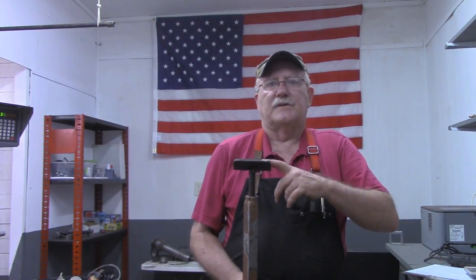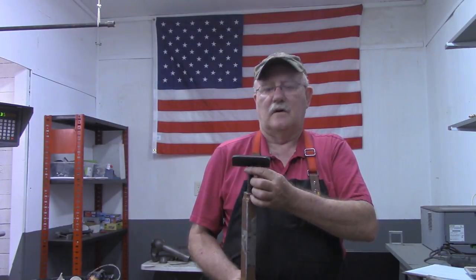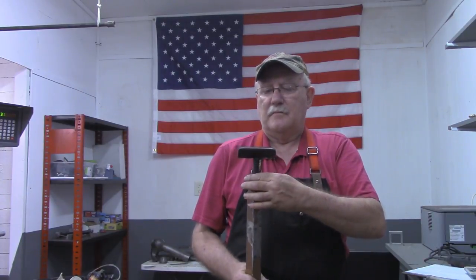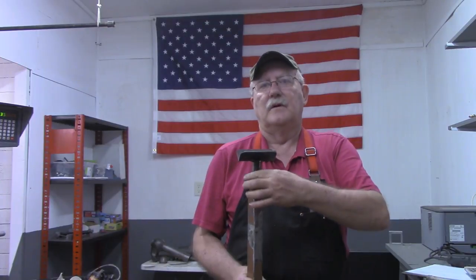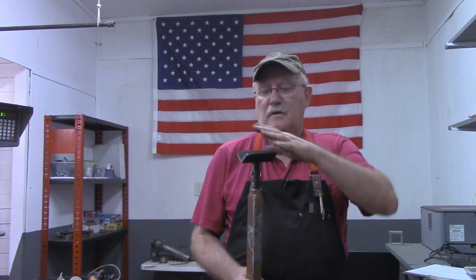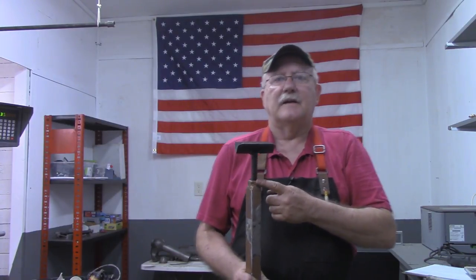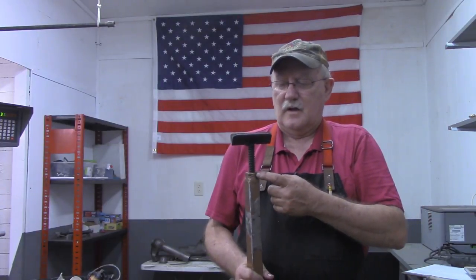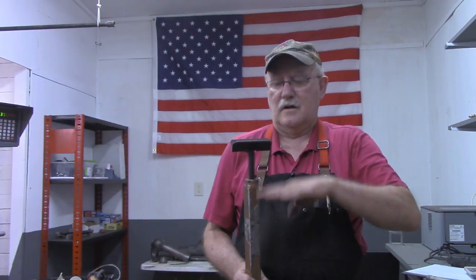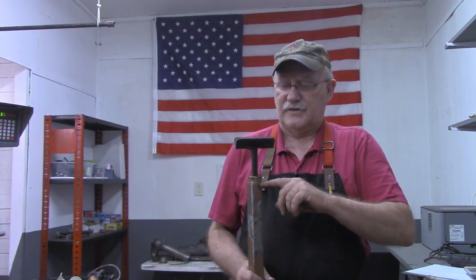The third problem with this up here was I made this rigid to the piece of Acme rod here. I believe that's 3/4 inch Acme, meaning that I had to take the material off to run the screw up and down, which would have been much better if this had stayed stationary. Now, ideally, the nut that's on here, I would have put a T-handle off each side of the nut and used it to run up and down, maybe just let it ride on this surface.